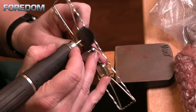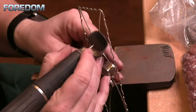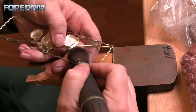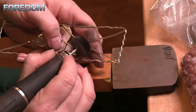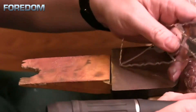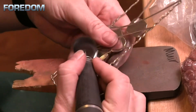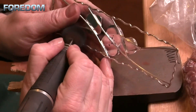When you go into a polishing compound you want to use something nice and fluffy and soft. If I'm using a cutting compound like Tripoli I want to use a brush or abrasive that is stiff and will help me remove things. But when it moves into a polish I want to use something with a soft touch. In this case I'm using a cotton buff — I'm not pushing hard and I'm allowing the machine and the compound to do the job for me. Not forcing anything to happen is really important when it comes to polishing.